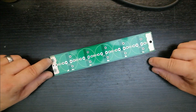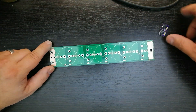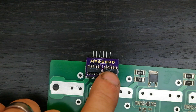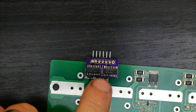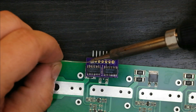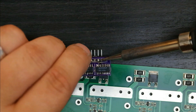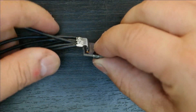There we go — I've got my two bus bars and six connections that I'm going to need for the balancing circuit. I'm putting an angled header on my little MOSFET board so it's easier to put wires onto, since my holes are too small. There are only six holes populated, not the seventh, because this board was originally designed for a six-cell series. We're just going to short out that last hole at the bottom — putting both ground connections together — and that makes it compatible with five cells.